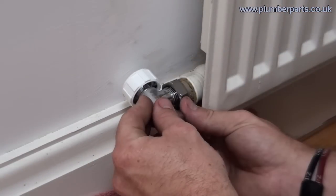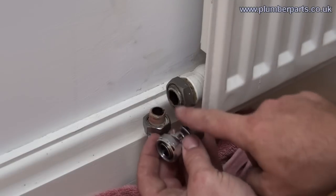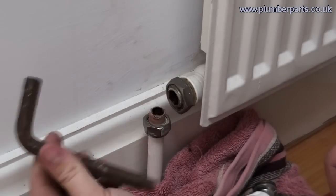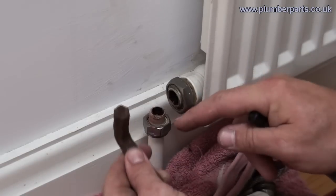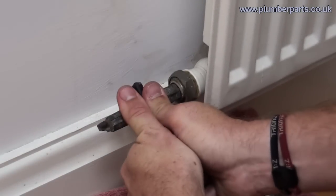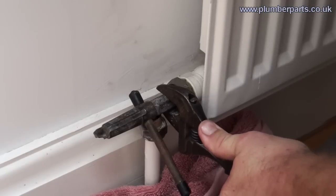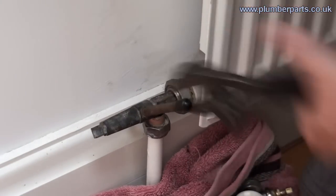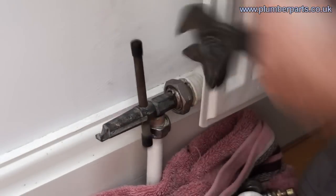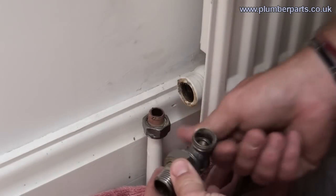As you can see, our new TRV isn't going to fit on this current radiator insert. All new TRVs are supplied with a new insert, so this one here will need removing. There are special tools to do this — you can have a hexagonal tool, a square tool, or a lug tool. Today I'm going to use the hexagonal fitting on there. You can just lift that up and move it around, or generally you'll need an adjustable spanner to wind it out. There's the old insert out and that's the old valve completely removed.